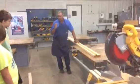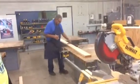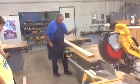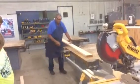I'm gonna put the saw blade right in the middle of the mark. Okay, so I'm gonna be taking a 1/16 off of both sides. All right, not super critical, but we do need to be about half. We need to be about half so that I can get two of them out of there. All right. I'm going to bring it over here to the saw.